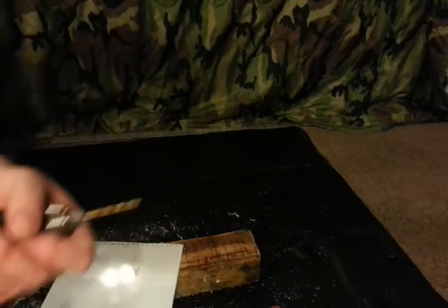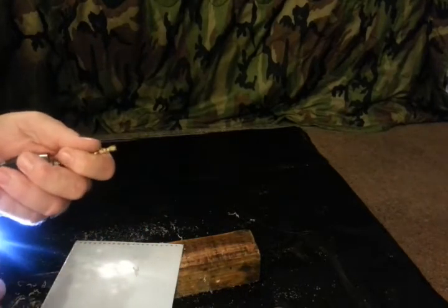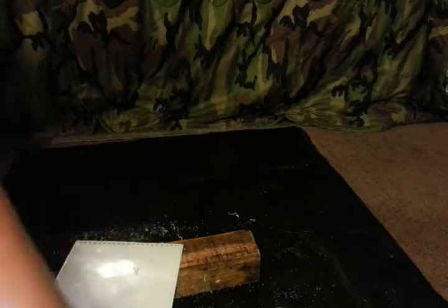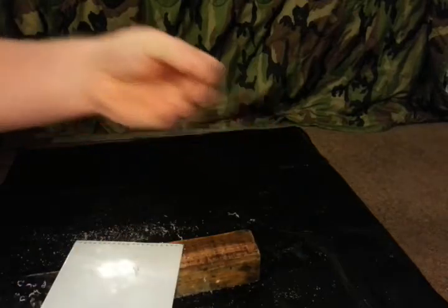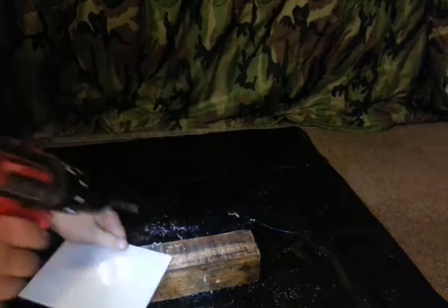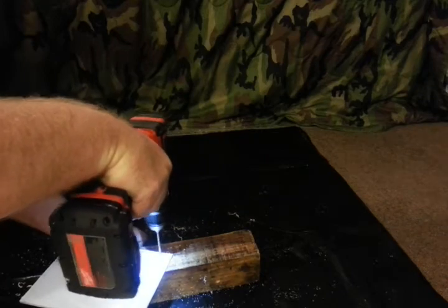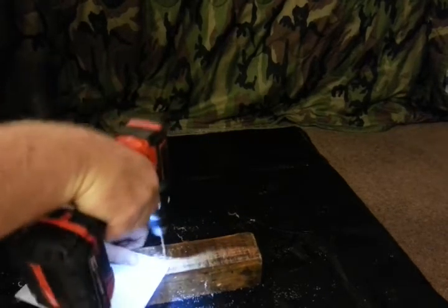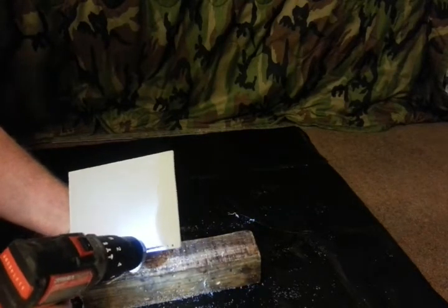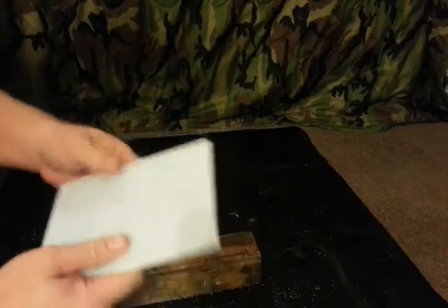Now with your pilot drill done, I'll use a little bit bigger one to give it some room. The reason is that whenever you're opening and closing your binder, it's got a little bit of play in it, so that way it doesn't bite and sit real flat, almost at an angle. So we do it for the last three, on both sides, so it gets some of that excess off. And all your holes are drilled.